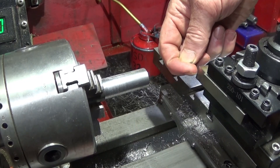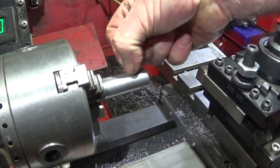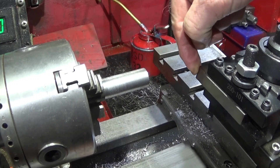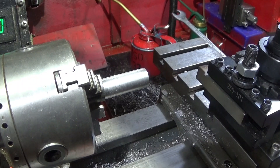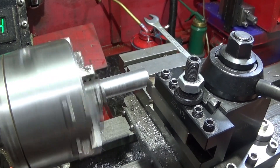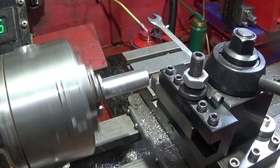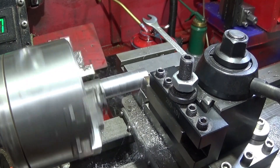So this is the setup. I've set it so that the middle of the tool's cutting edge will touch on the diameter. This is a piece of mild steel, which is very hard to get a good finish on with whatever tools you use — you can hear it's quite a rough, liney finish. So now I'll bring the tool in to touch this diameter and then take a thou or two off. As you can see, there's very fine swarf that the tool takes off.